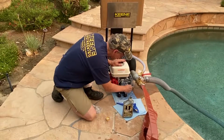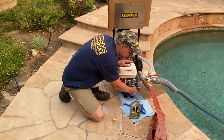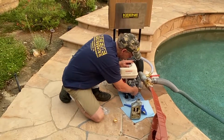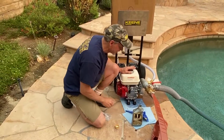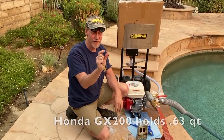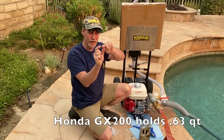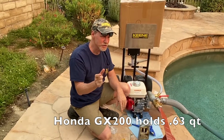Okay. So I've got my oil. I'm up to about just a couple threads down from the top, or halfway up those threads is kind of how I set it. So when you look down the stem, you'll see a section about 1 inch in threads. I usually have my oil climb about halfway up the threads. You can go a little higher, you're okay, but you don't want to go too much.